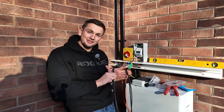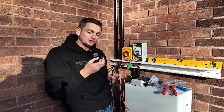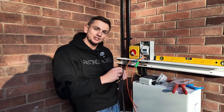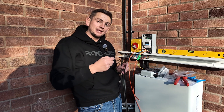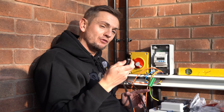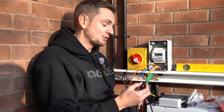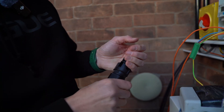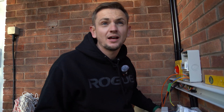This Alpha battery can accept two strings — two circuits essentially — and the cables are polarity-based: positive and negative, eight panels per string. When wiring into the inverter there are respective female and male connectors. You cut the cable, strip it back, terminate it, and crimp it with a special tool. DC can arc if you touch positive to negative — it will keep arcing until you separate them. These MC4s are fully double-insulated so technically they could go near each other without arcing, but you should always keep them separate.